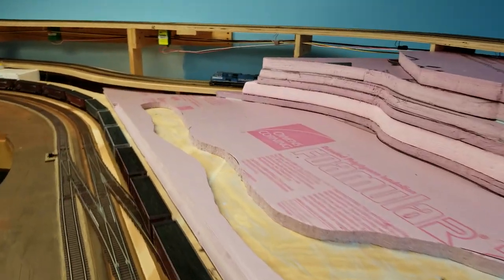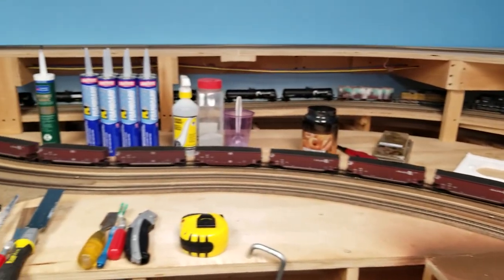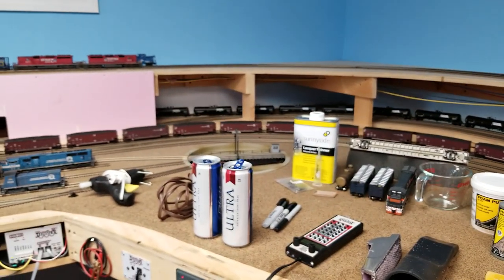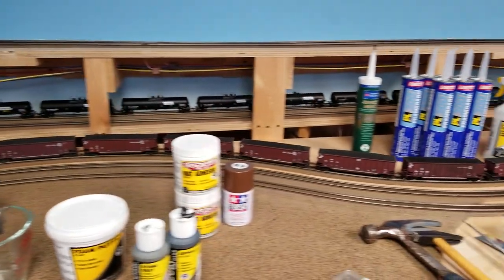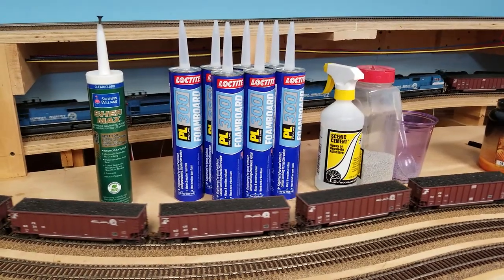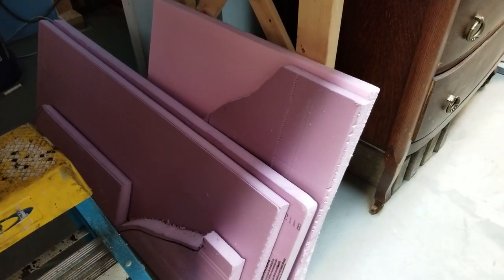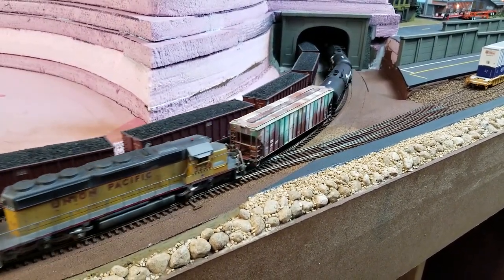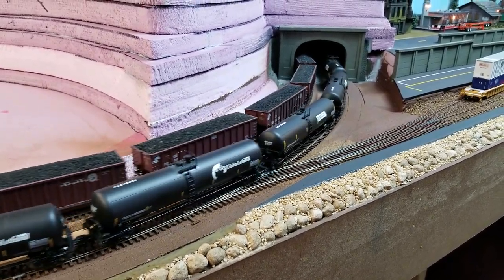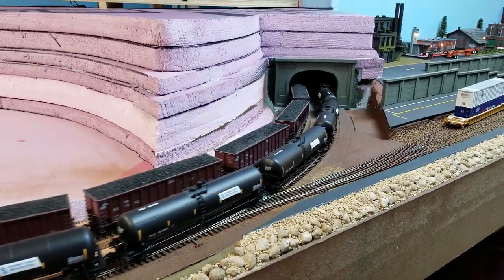If we ever get out of this corner, I'm going to bring it around here — there'll be another porthole there. Then I'm going to bring that pink board around the back to join up to that pink board. It's going to be one long winter of foam board, but we've got plenty of glue. The two-inch foam board comes in four by eight sheets, but it's perforated so you can snap it with your knee and break it down into 16-inch lengths — 16 by 8, or even 16 by 4. You can put a whole four by eight sheet under your arm by the time you're breaking it down. The two-inch goes a lot quicker than the one-inch.